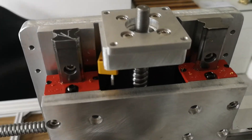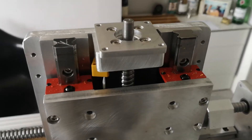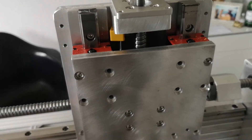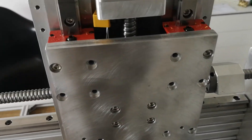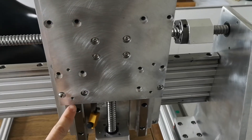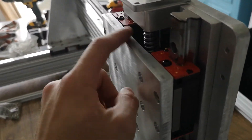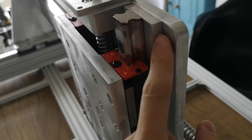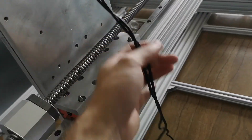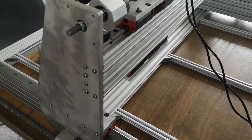For the Z carriage it's slightly different. I started with the idea of buying multiple sheets of aluminium at different thicknesses, but trying to calculate what I might need was getting confusing. So I just bought a massive 88 by 100cm sheet of 12mm aluminium and milled everything to the required thickness. You've got your Z plate here with your ball screw in the middle, and I've got spindle mounting points here, here, here, and here. I've milled the base of the spindle bracket along the side for clearance around the ball screw — one millimetre deep there — and taken that bracket down to 10mm. I'm also starting to get electronics sorted, with proximity switches coming, but I'm waiting on screws before I start that.